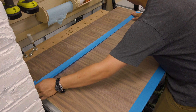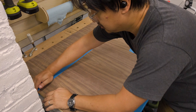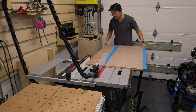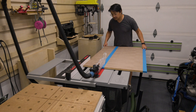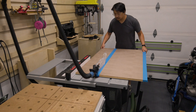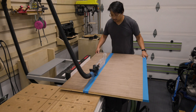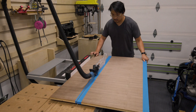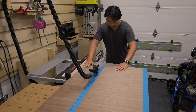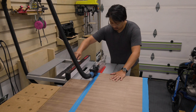Here I'm going to break down all my sheets to make the body of the table. I'm putting down blue painters tape over the edges where I'm going to run my blade across. This will help with any tearout that happens on the surface of the plywood — you especially get this when cutting across the grain on the top and bottom sheets. The grain is running left to right and I'm cutting up and down, so we'd experience tearout if it wasn't for the blue tape.